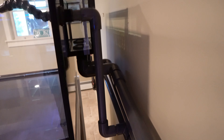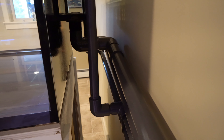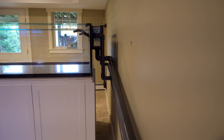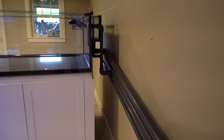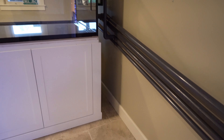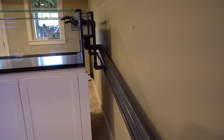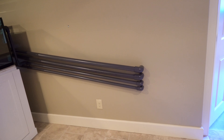I needed to take into account that I needed a couple of different 90 degree elbows, so I needed that spacing between the tank and the wall. I didn't want the tank very close up to the wall — I needed some room for those two 90 degree elbows going out. So I had to kind of plan ahead for that. I had to make sure that the stand and the tank were at a certain distance. You really have to plan ahead and think about all the different possibilities.